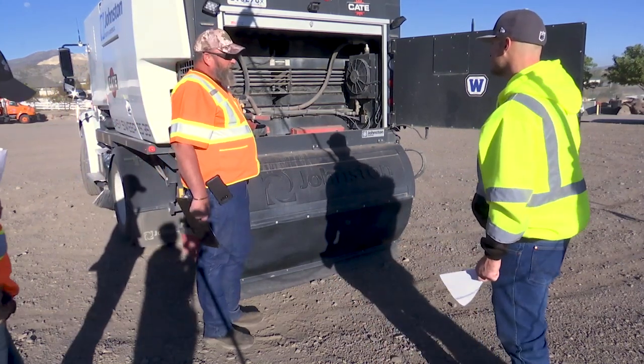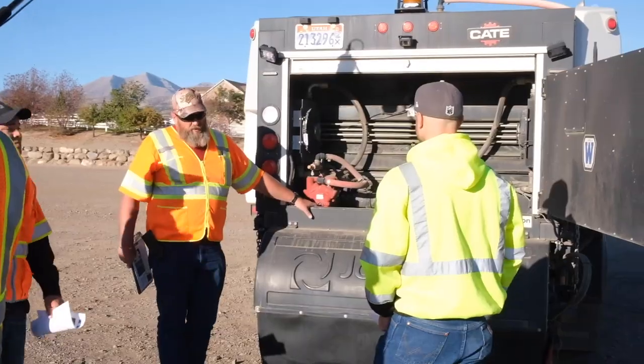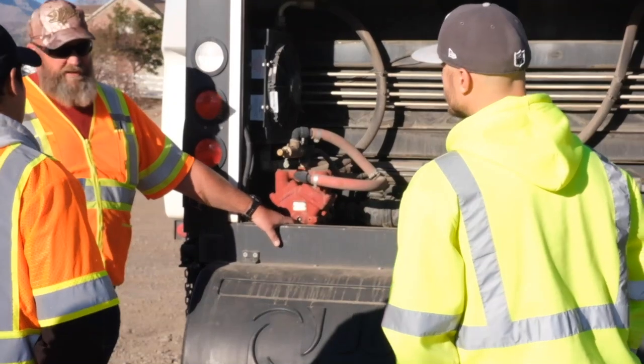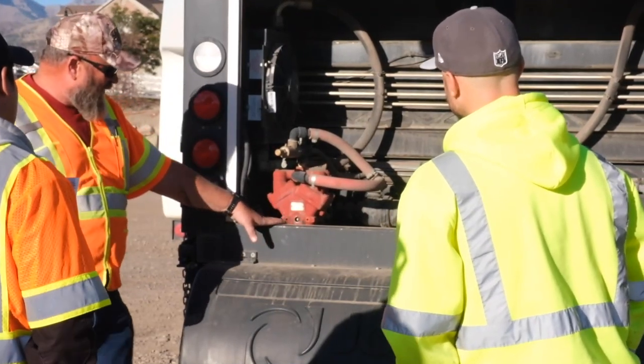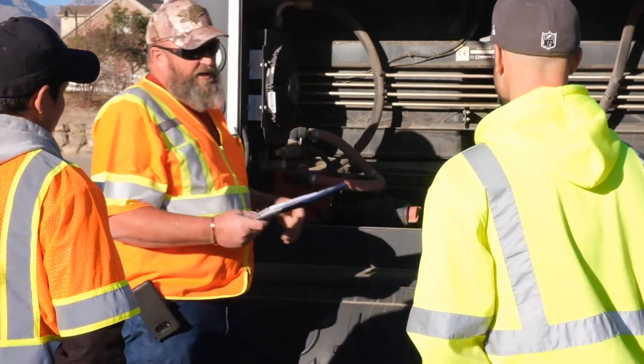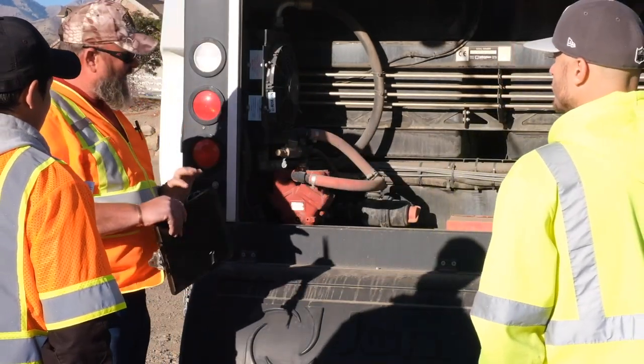Another location — I do this one every couple days. There's a grease circuit right here for the water pump. I give that one three to five shots. If you give it too much, you may have some water blow-by here. This right here is your water filter. You don't need to drain your tank to change your water filter — it's a cool system. You've got a red handle right here. After you turn that, it'll actually pop out a little bit, and that seals water off from the main tanks down to the water pump.